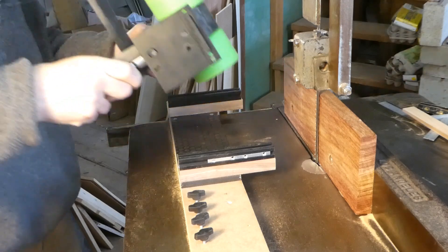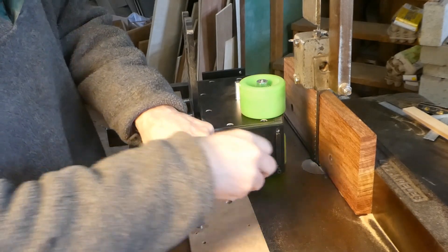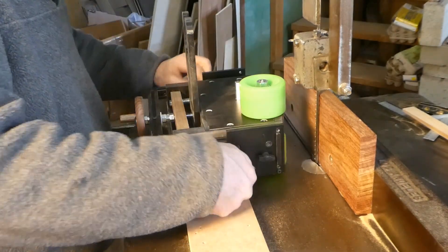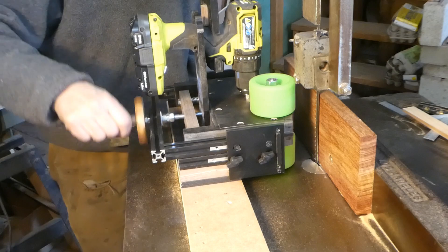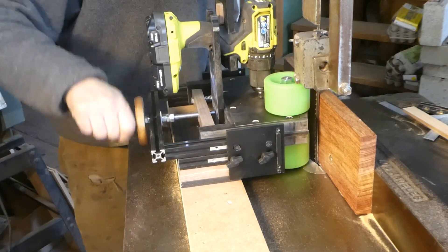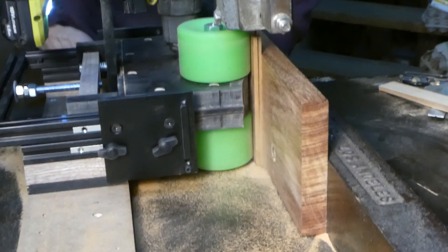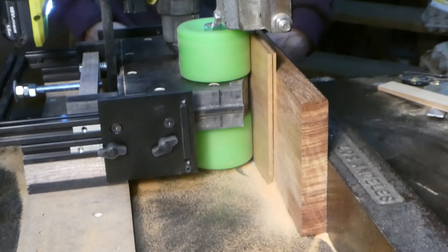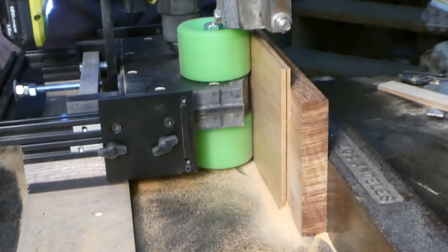The Little Proteus can also be mounted parallel to a tall fence on the provided bandsaw holder. For re-sawing, you'll get pressure at the top and bottom of a six-inch wide board — nearly double the height of the least expensive industrial bandsaw feeder at less than half the cost. Ultra slow feed speeds and super lightweight permit re-saw use on bandsaws too small for any other feeder.